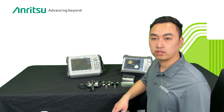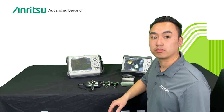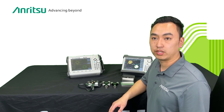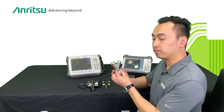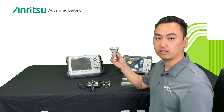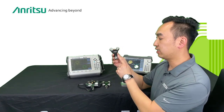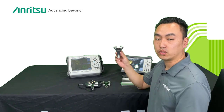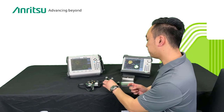Calibration kit is super important in terms of a VNA. Without a correct calibration, you will get poor measurements and invalid measurements for the most part. Today I'm going to show you first some of the different types of calibration kits out there, then define all the different terms and how you can enter them into the instrument. First, I'm going to talk about OSLs. Here I have a calibration kit known as an OSL — O stands for open, short, and load. These are N-type connectors, and the connector type and frequency make a big difference, especially when you enter correction factors into the instrument.